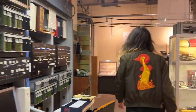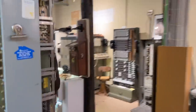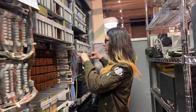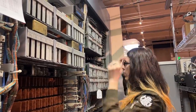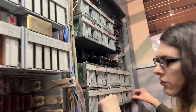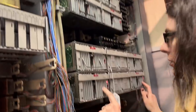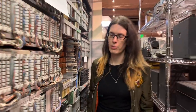The next thing we have to do is turn on the power converters. These are in the power frame — there are eight of them. Then clear the alarms when possible by pushing these little switches up. These ones don't go out of alarm until the machine comes on; they need to be reset by the processor.